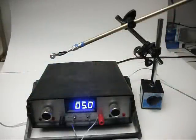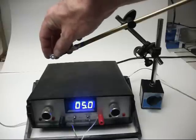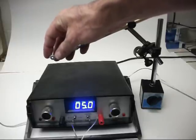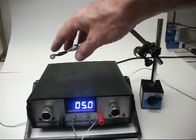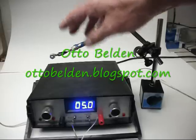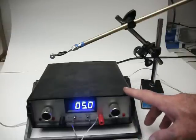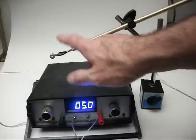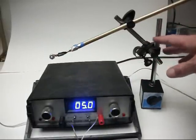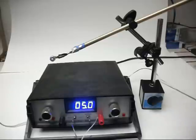The light source that I use is an LED. I ground the bullet lens end of it off, wrapped it in aluminum tape, and then poked a hole in the middle, so it's just a pinpoint of light. I got that idea from another site about Schlieren photography. The LED is powered by a homemade power supply that I built about a year ago — there are details of how I did that on my blog as well. The wires for the LED are run through a brass tube and then held by one of these magnetic bases. It's adjustable in every direction, so I can use that to position the light right at the focal point of the mirror.